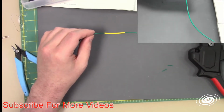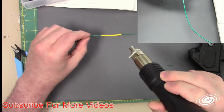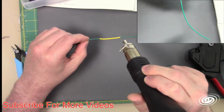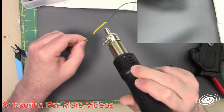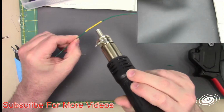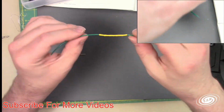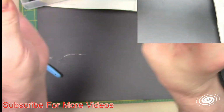Then I'm going to grab my heat gun. That is probably way too hot for this, but I'll hold it kind of far away. And I will heat this heat shrink up. Now this is 2 times heat shrink. I normally use 3 times heat shrink. You know, it shrinks 3 times smaller. But this is what's in this drawer, and I didn't feel like digging out my 3 times stuff. So that is done. Put my hot air gun back. And then that is heat shrunk on there. And we have a repaired joint that's not going to come apart.